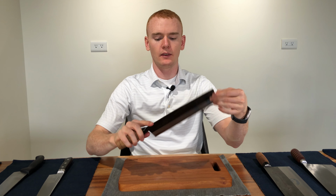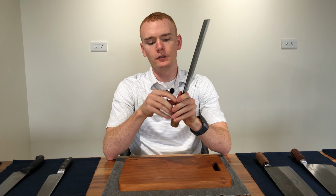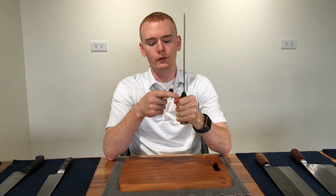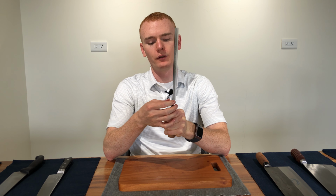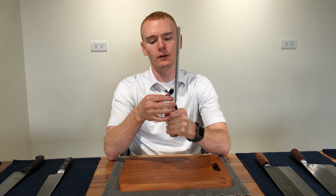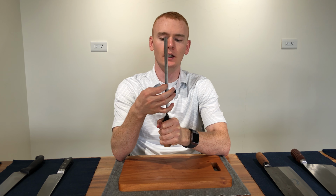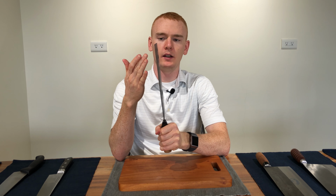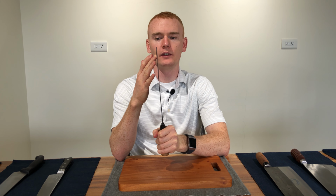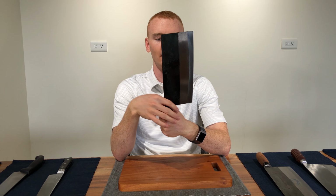This blade thickness along the stem tapers from the full tang area where it thickens out for more support for the tang. At its thickest, it's about 3 millimeters. Here it quickly thins out to about 2 millimeters and then progressively tapers down to less than 1 millimeter thick along the spine at the tip of the rectangular blade.